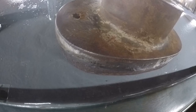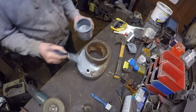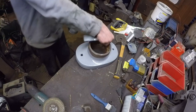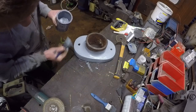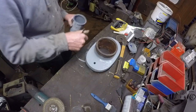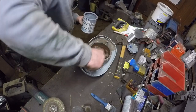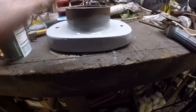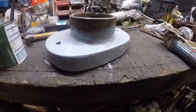Jobs are good done. Drop the primer - these all end up black and greasy within the first five minutes anyway. Cut paint, make it look nice and tidy. Nice, quick, easy, cheap and effective - and long-lasting as well. Turn it up the other way, do the bottom edge. There you go then - jobs are a cracker. One angled chimney collar to go back on the roof with no bits of wood and no bits of brick or cement involved. Beautiful.